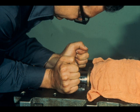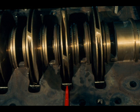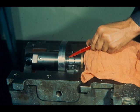He pushes the pump rotating assembly toward the inboard end of the pump until the thrust collar rests firmly against the thrust shoes. It can now be determined if the position of the rotating assembly within its casing is correct. By looking closely at the location of the impellers in the bottom half of the case, we can see that they are positioned correctly. However, if the position of the rotating assembly is incorrect, the correction will be made with the shim. If the assembly is too far toward the inboard end, we would remove the shim and machine the correct amount from its length. If the assembly is too far toward the outboard end, a longer shim would be required. If you have any doubts, consult the manufacturer's manual or ask your supervisor.